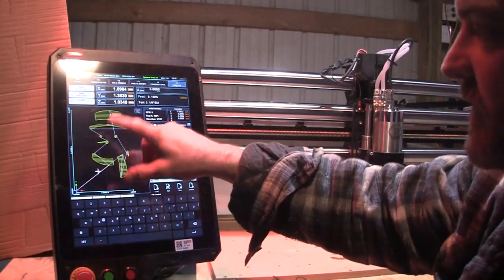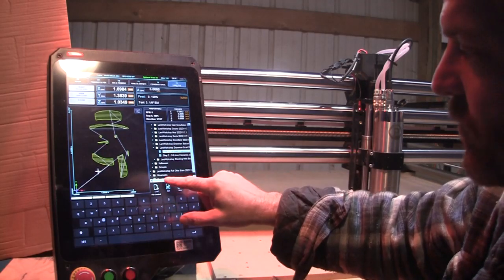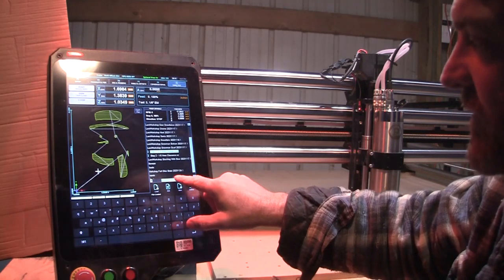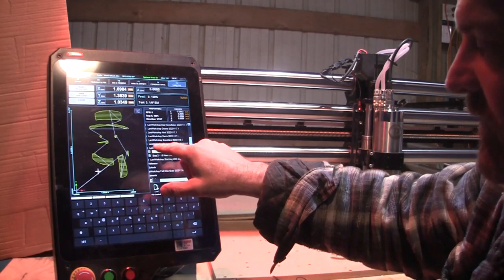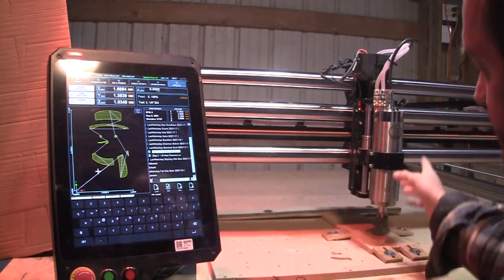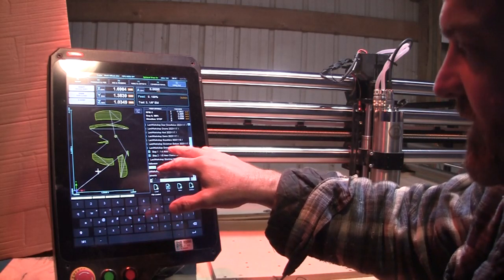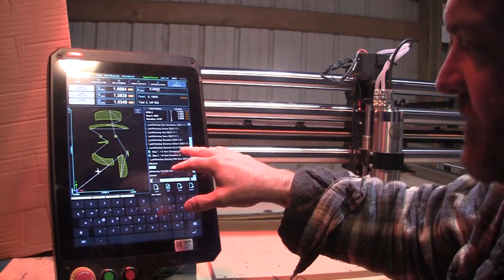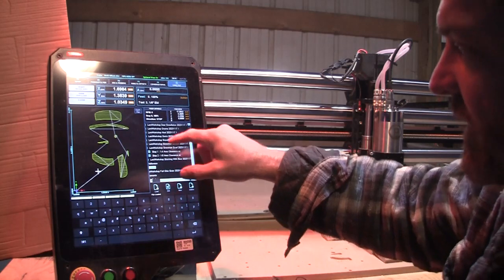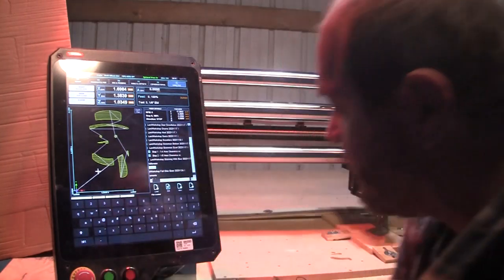So the first thing we're going to do is load up one of the files for the lantern face. This is Snowman Scarf. I always label my things with step one, and then the bit, and then what exactly am I doing with it. It makes things easier for later. I also have a little program that takes my G-code that I export from Carveco and cleans it up a lot. And you're going to see a lot of that happen on the spindle here. So I always put Lars Workshop, the directory Snowman Scarf, and then the date that it was done. So this was just created on 11/17, and 0.1 is a version of it. So I know what version I always carry on my jump drive or flash drive, whatever you want to call them.